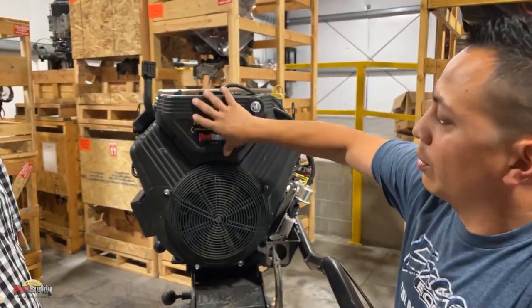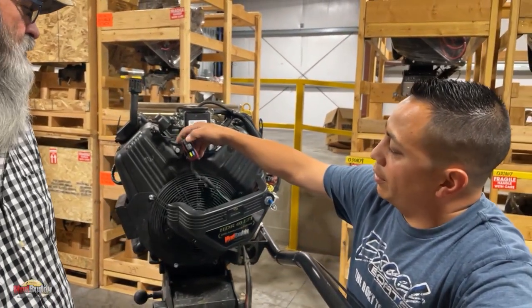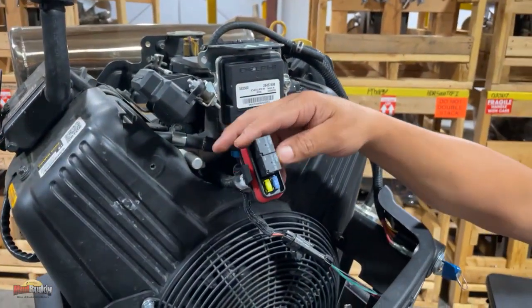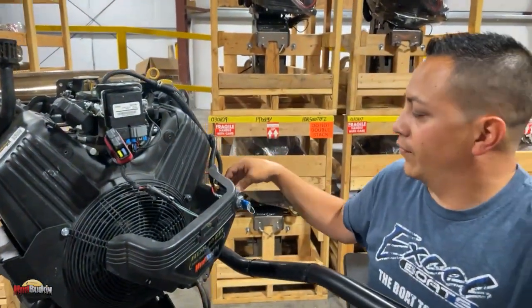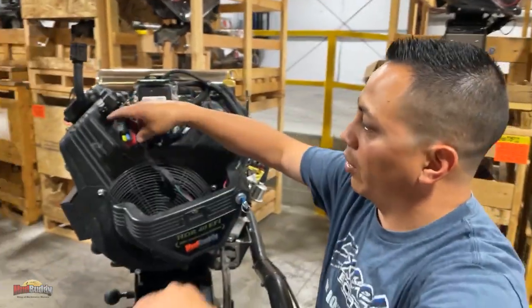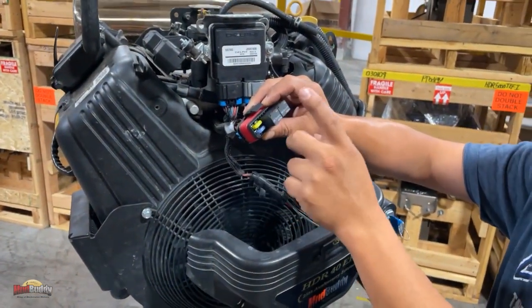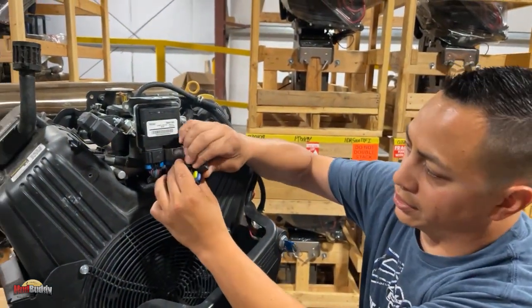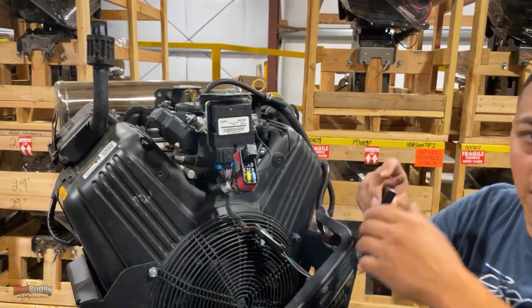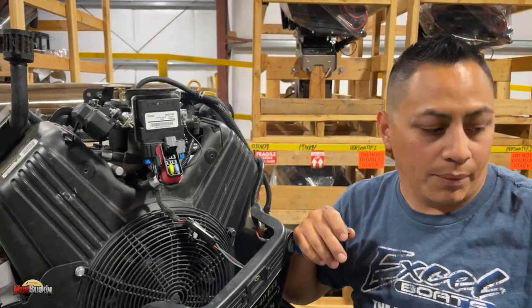What I recommend doing is removing this front cover to get access to the fuses and relays. This relay right here is for the fuel system outside of the engine — the fuel pump out here or the one mounted on the transom of the boat. This one controls the injectors, coils, and all the system in here — sensors and whatnot. I remove this relay so I don't have spark and I don't get fuel being injected into the cylinders.